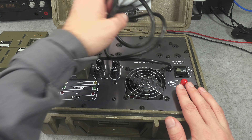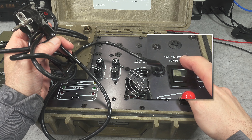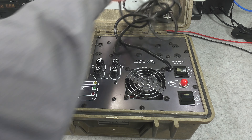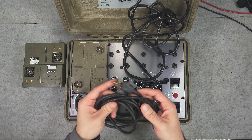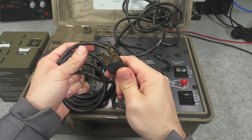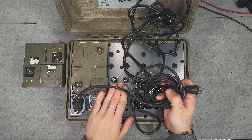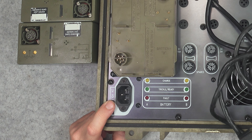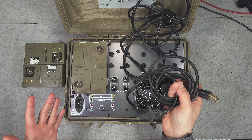This charger is absolutely beautiful because it can be powered from AC or DC. Here we've got the AC plug, and the power cord attaches to the body. It accepts 100 to 250 volt AC. But here we've got something extremely funny — there's a connector that looks like a standard AC cord input, and you could technically plug it into your wall. However, if you do, you will burn your charger, because this is the 24 volt DC input. It's an accident waiting to happen.